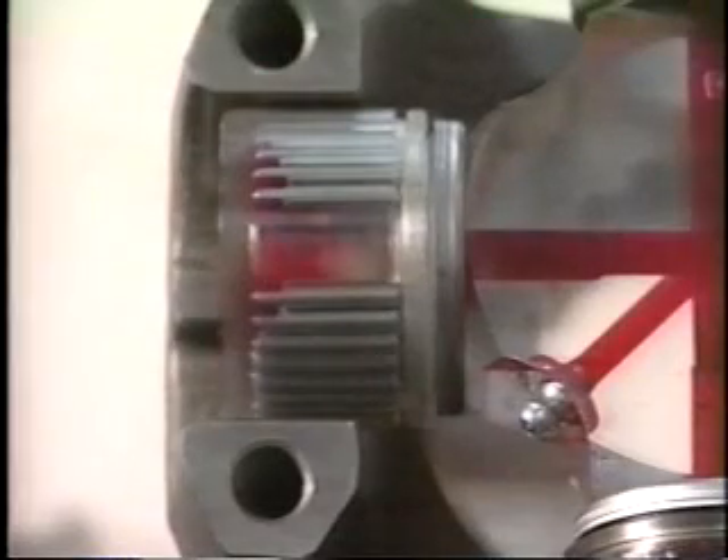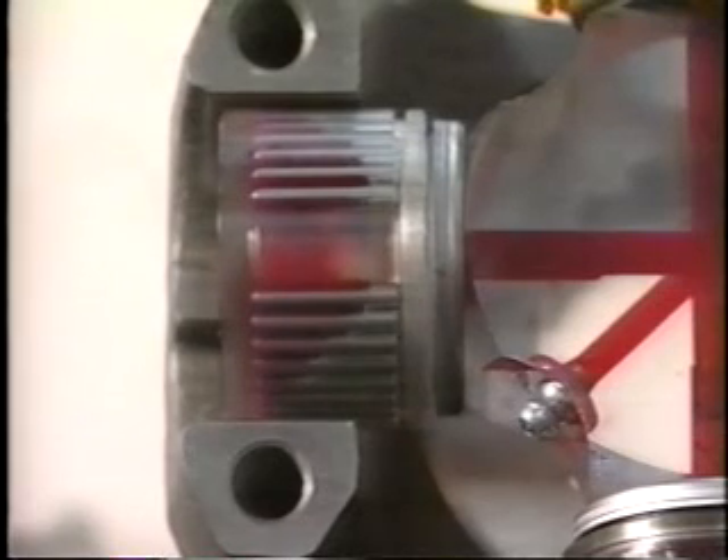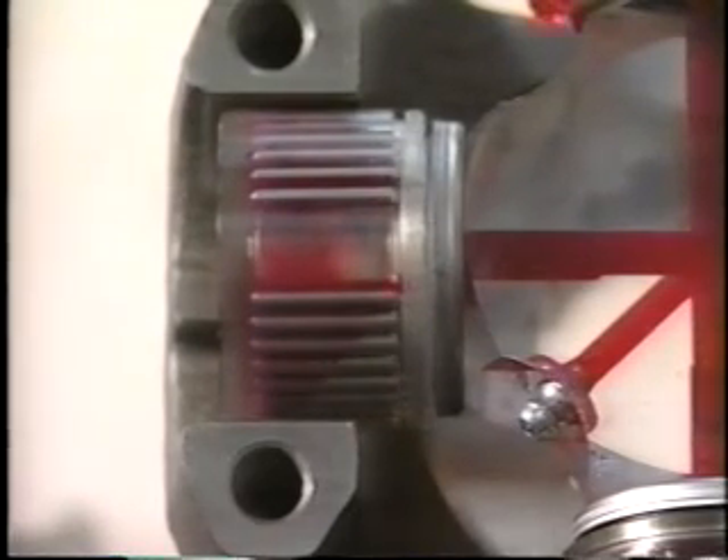Next, the lube simultaneously fills the bearing cup around the needle bearings and the cavity around the PPV valve. Notice the bearing seal purges air and liquid contaminants prior to purging grease from the seals.